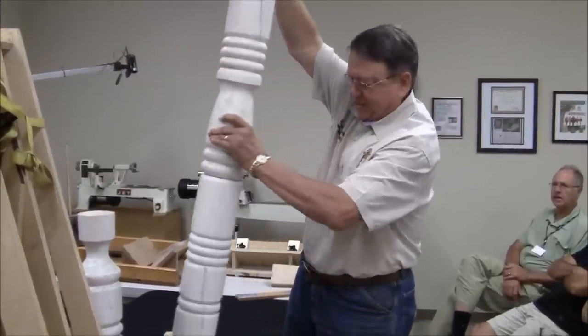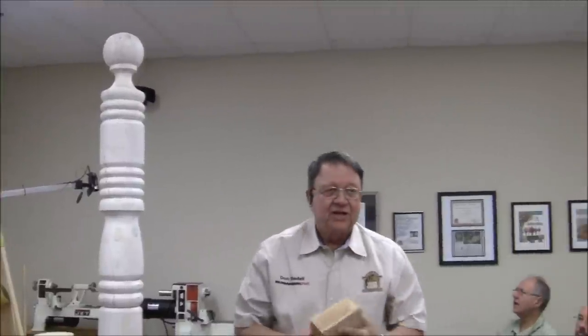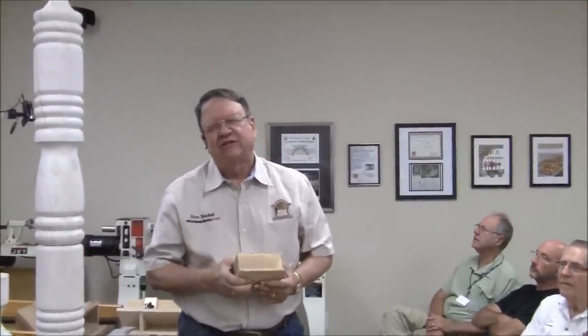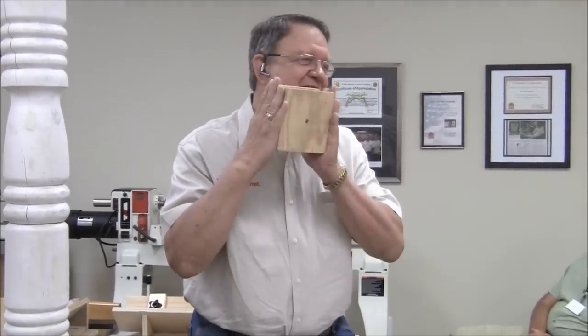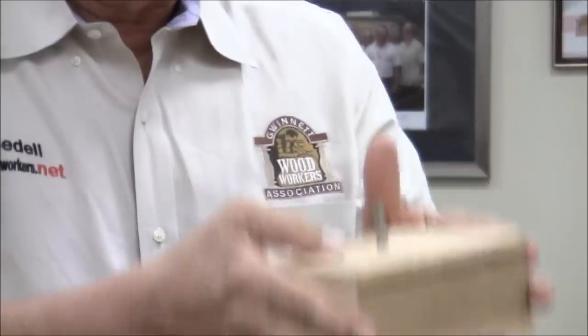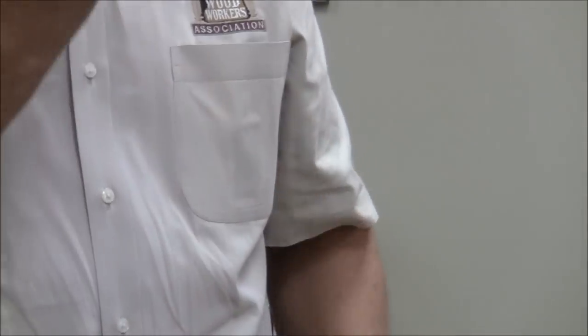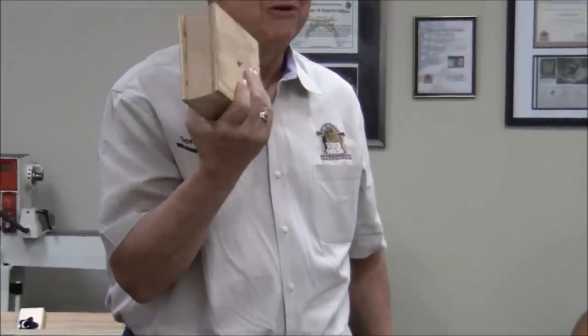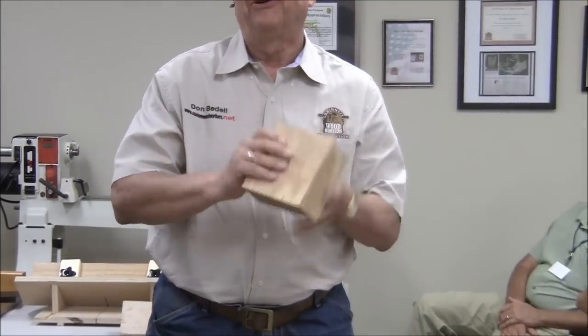Chess pieces? I had a prop. Those are small chess pieces. I'll do this one first. If you have to do a whole bunch, like one time I had 200 bobbins, you have to center the wood before you put it on the lathe. If you make something like this, which is exact, 4 inches or 6 inches, you just line it up. By lining it up, you'll know whether your piece is square or not. Tap it once with this, and you've got your center done. It's worth the trouble making it, because it's centered real quick. Is that spring loaded? No, I just hit it out with a hammer and hit it back in again.